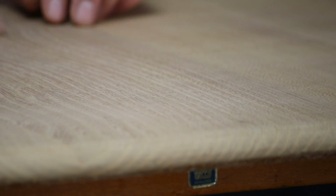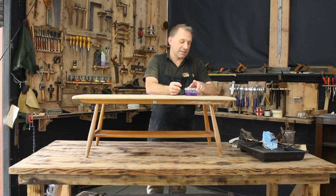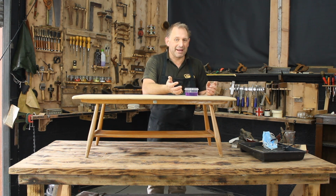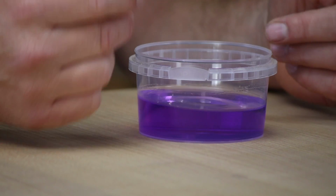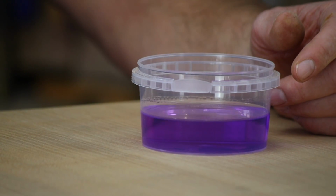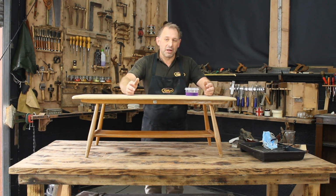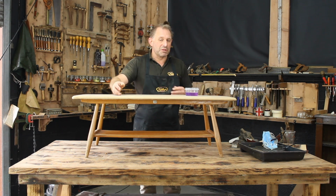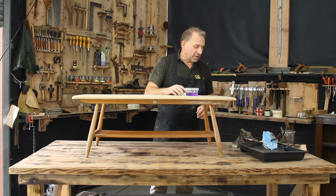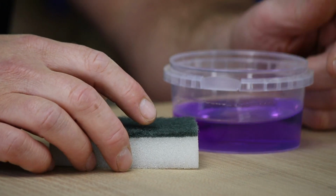the surface with some methylated spirits and a little bit of acetic acid, which is pickling vinegar. It's about 10% pickling vinegar or acetic acid in here, just to try and neutralise the solvent solution that I used in that paint stripper, which is an alkali solution. The ones you use at home in a domestic are probably water-based, so you can neutralise them with water or just wash the surface with water. But I'm going to use a little sponge and some methylated spirits.